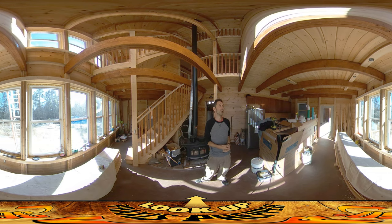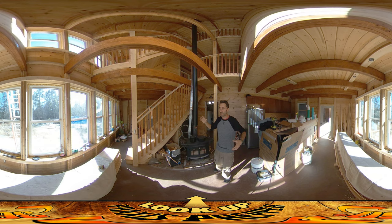The other thing going on today is doing a real burn on the wood stove. We've been doing just a little bit of burning scraps to make it comfortable in here, but today it was like 20 degrees when we got here, maybe 30 degrees outside right now. We're doing a real burn on the wood stove to get this place heated up and see how the floor performs. We're sending a lot of heat up to the top of the house, it's going straight up and we're venting that down under the floor. So far it's working really well — the hot air coming out of the exit vent is coming out in the upper 50s, which means we're storing an enormous amount of heat down in the slab, which is really going to moderate the temperature swings in the house.